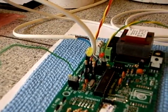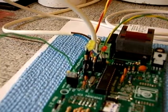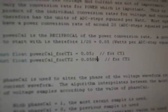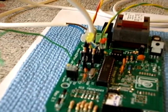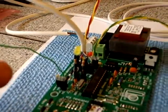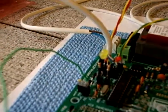So the cal value for CT2 is too high relative to CT1. We started with a cal value of 0.0506, which was too slow. I moved it to 0.0509, which was too fast, and the value I had before I started was roughly 0.05075 — midway between the 506 and the 509. You can synchronise the two channels at any time by earthing R11, which is connected to Digital 14 or Analog 0, and so we're now back in sync.